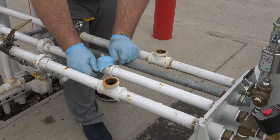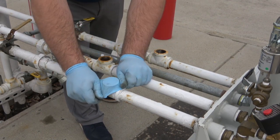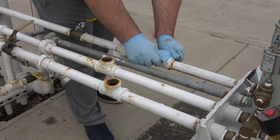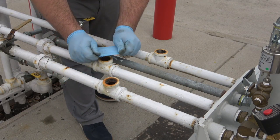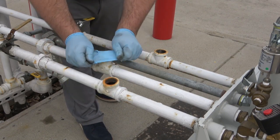During the purge mode, place your hand over each open T-fitting. You should feel the following: no blowing or suction at the vapor inlet T, no blowing or suction from the air outlet, and air blowing from the vapor return. Again, if there is suction or air blowing from anywhere unexpected, refer to the troubleshooting section of the Green Machine Manual in Chapter 8.